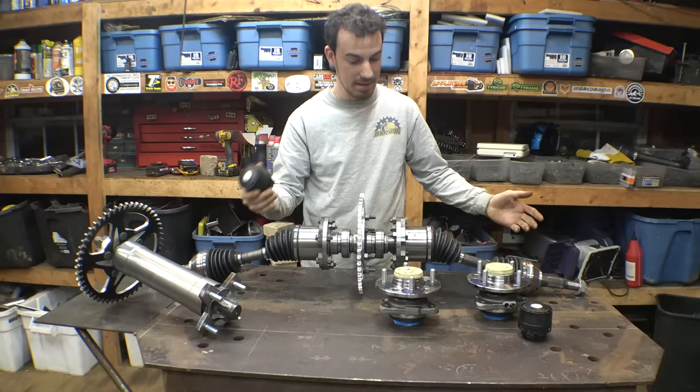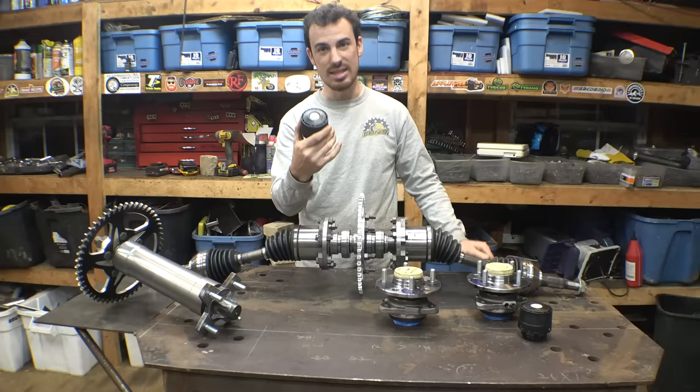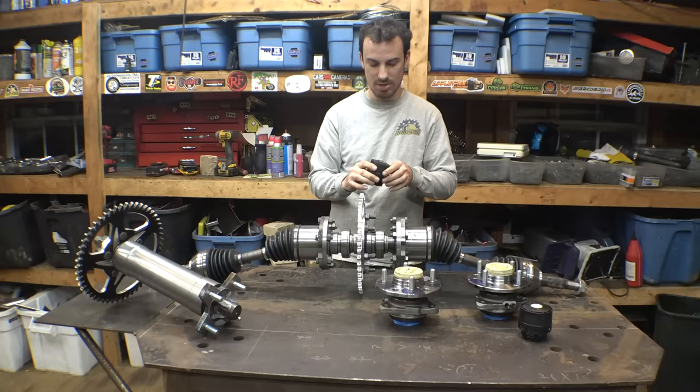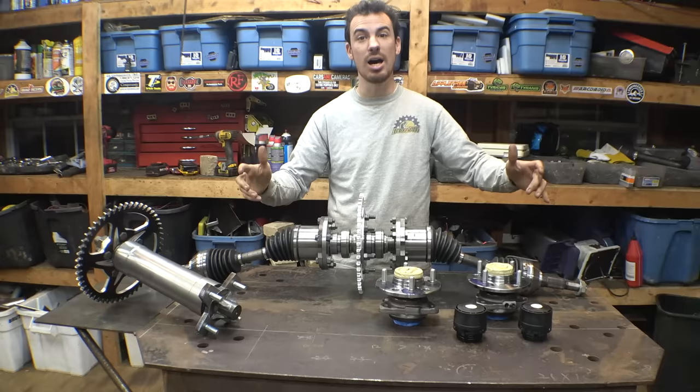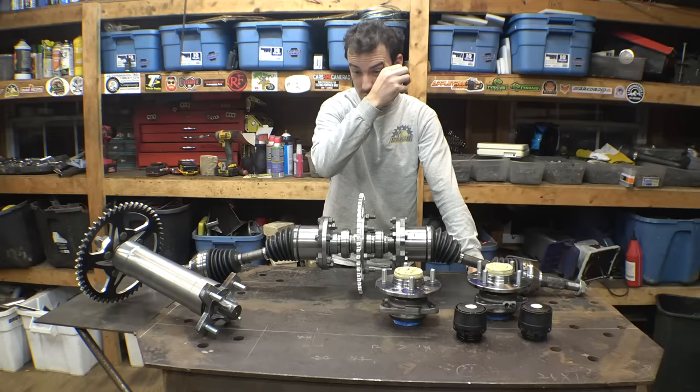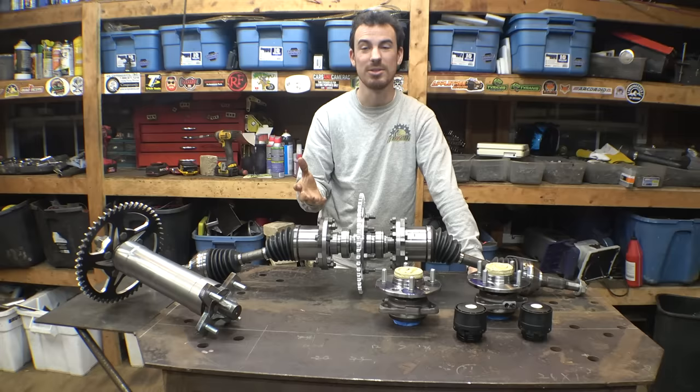I have found these, and by the way, these CV axles and these hubs are from a 1999 Ford Ranger. And these, I believe, are called momentary vacuum locking hubs. I was really trying to figure out a way to have locking hubs where I didn't have to get out of the vehicle and manually lock them. I know that's really popular with Ford Rangers, and I didn't want to have to do that. It'd be awesome if I could hit a button or move a dial or something and be able to have